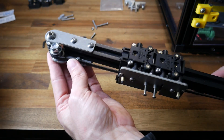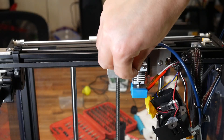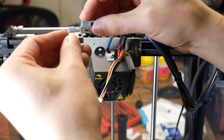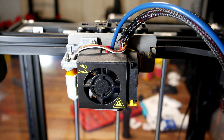That's most of our assembly finished, which means we're now ready to fit it to the printer frame. I figured now was a good time to reassemble the hot end. When you bolt it on, just make sure you keep the spacers behind as we already had set up. Everything goes back together in the same way. The only change I had to make was grinding a hole in the back of my BL Touch bracket to clear the higher belt.